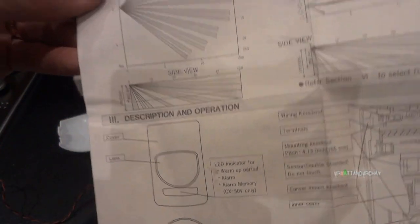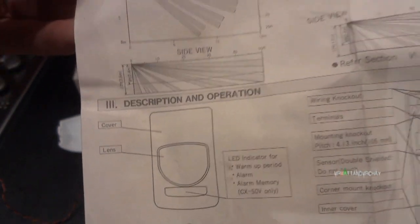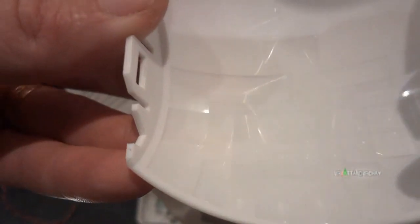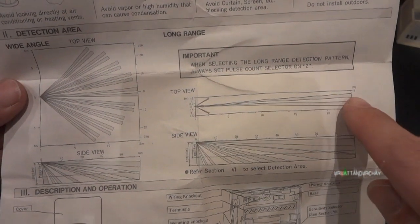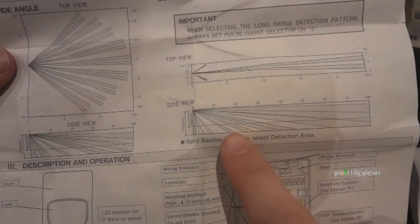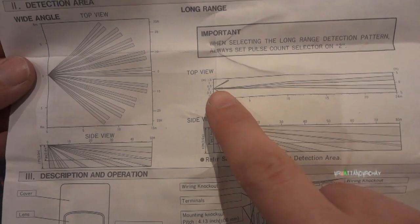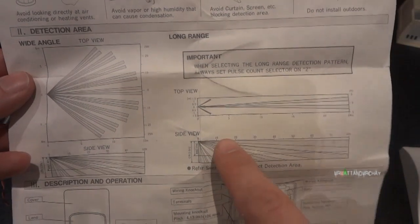Looking at the lens pattern - mounted on the wall and viewed from above, there's your 90-degree detection angle. Viewed from the side, these are all your zones going down: one, two, three, four, five, six, seven, eight zones. There are quite a few zones on that compared to normal PIRs. If you changed it around and made it long-range, you don't get the spread of 90 degrees - you've only got one main beam going down there, plus two nearby that look underneath. This is not a standard long-range lens that only looks along one level; this has the potential to look down as well.